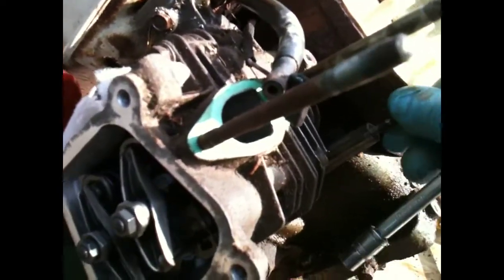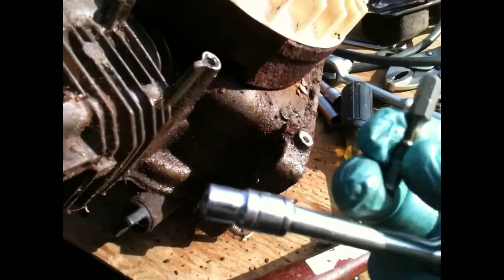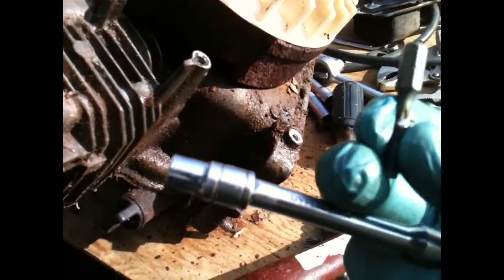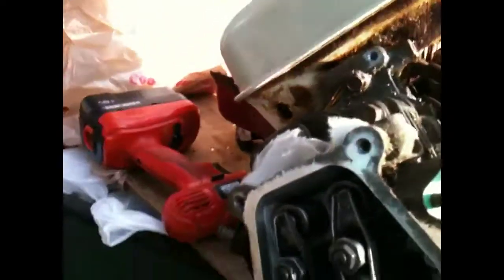There she goes — this one came out a lot easier than I expected. That's how to extract a broken bolt. If you can get a pilot hole drilled on the end of it, that works well. You do have to be careful though, because sometimes these Torx bits can break off in there and they're a bugger to drill out. Here you can see the pilot hole I've drilled on this second one — using a really small bit.